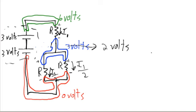And I think that really answers the question. What makes it so that the electric field in this resistor is weaker than the electric field in this resistor? Well, if I imagine cooking up a situation where they're the same as they were when I had that wire, then once I go to the actual circuit and remove that wire, you can see that the unbalanced flow of charge into and out of this blue conductor is going to make it so that the charge automatically changes in such a manner that the charge flow rate is the same at both parts of the circuit. The total charge flow rate through this pair of resistors has got to be the same as the charge flow rate through that single resistor.